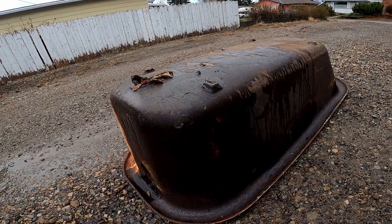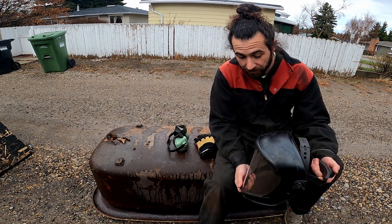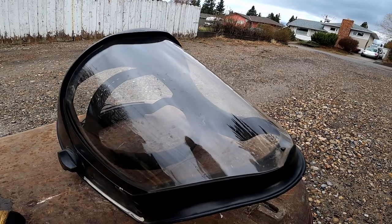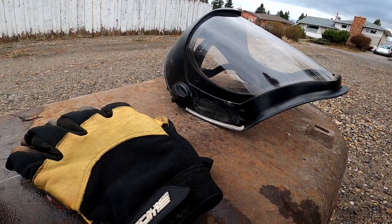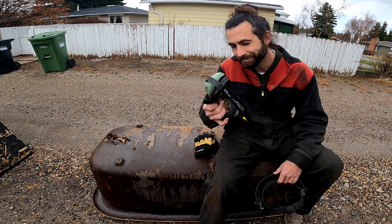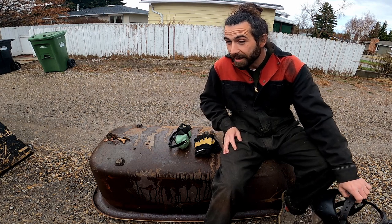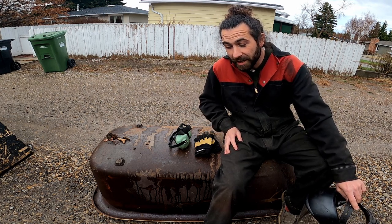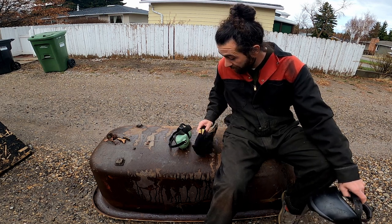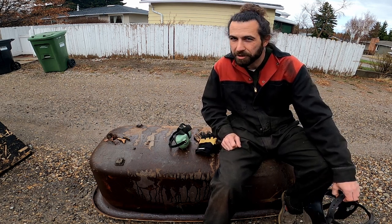Step one. First and foremost, you've got to wear the proper PPE, otherwise you're going to hurt yourself. For me, that's going to be a full face shield, because I want a little extra than just eye protection. And of course, gloves — wouldn't be without them. And this is going to be loud, so some ear protection is not a bad idea. Cast iron is very brittle. It's not like aluminum in that it can release a lot of energy if it's broken — that's why we have the PPE. Definitely wear the gloves.